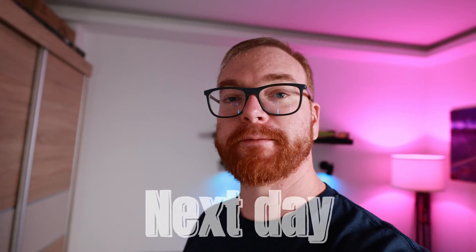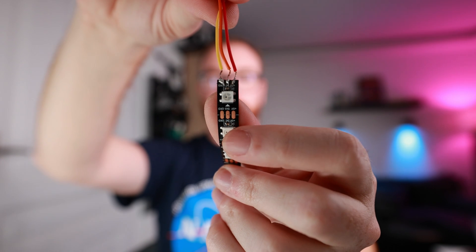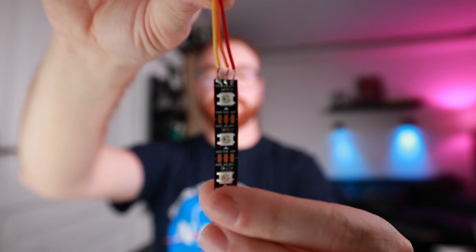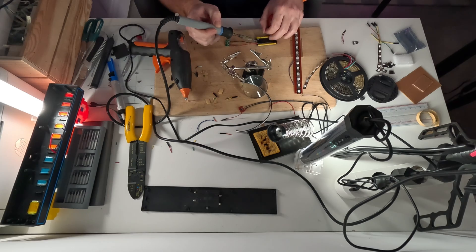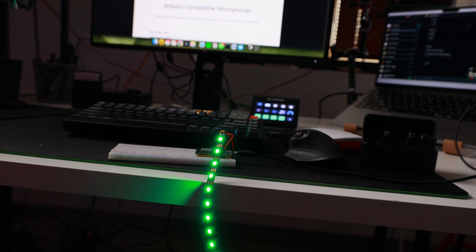This is the next day and I have no idea why my last step didn't work, but we'll find out together. I'm so stupid — literally it took me two minutes on a fresh mind. Can you guess why? Look at this — do you see the little arrow? That little arrow shows where the input is versus the output. I soldered to the wrong side. Let's solder to the other side and see if that works. The soldering is done — will it actually work? And it works! Look at this — I can do a bunch of different effects and even split it into two segments.